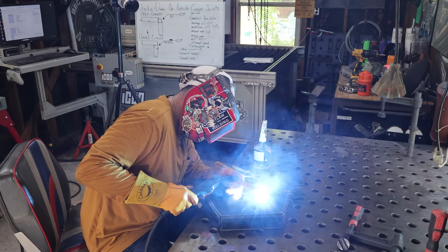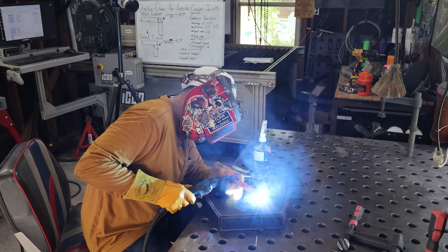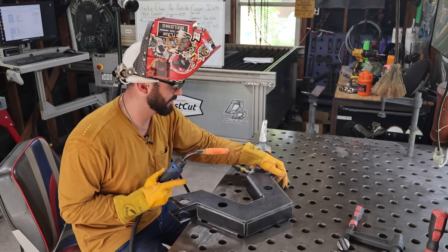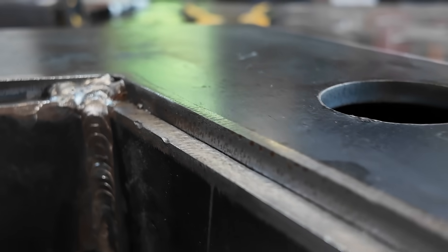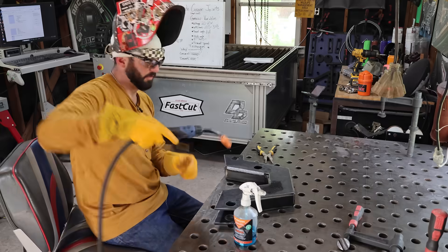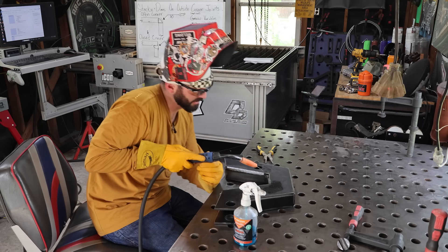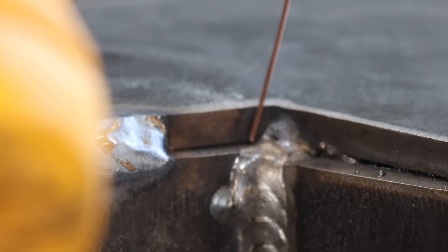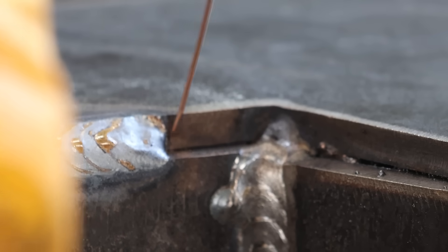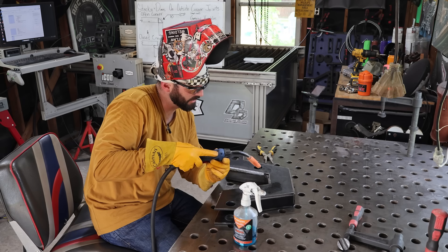I'm never disconnecting my wire from that weld puddle. We're going to make a little tie-in here — I'll show you what a tie-in looks like, as well as this inside corner where we've made kind of a mess with the fit-up. We're going to start way up here, and as soon as that arc establishes, we'll run back and just trace that crater. Remember we're doing cursive E, so we're going to come from the top and then drop back in to keep doing our pattern.